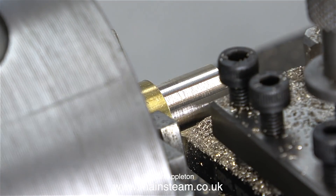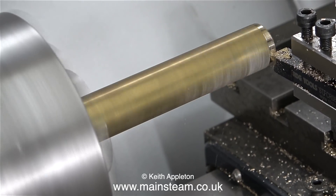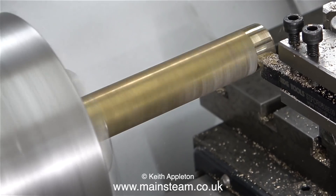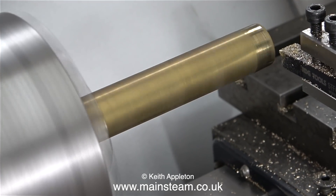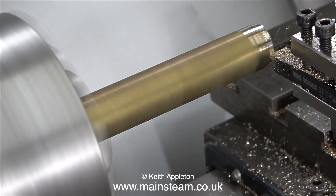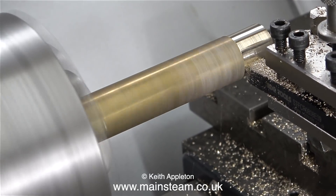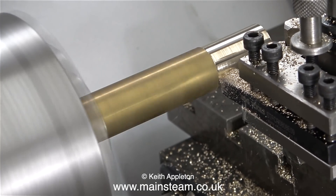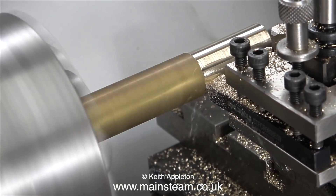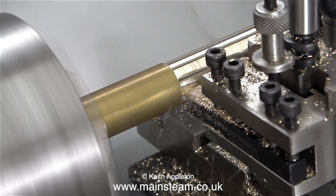I can't say I'm too thrilled with the surface finish in this clip, but it's really not important — most serious turning I'll do on my other lathes. On this Myford lathe the bearing arrangement on the headstock spindle is quite clever: at the front is a large taper bearing and the spindle has a large taper on it. There is too much end float and this can seriously affect taper bearings; the lateral movement of the spindle needs to be very tightly controlled, especially when drilling large holes.